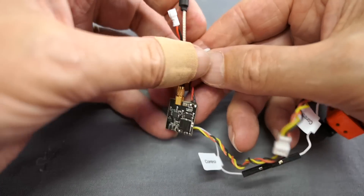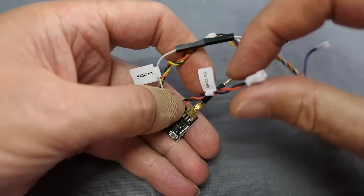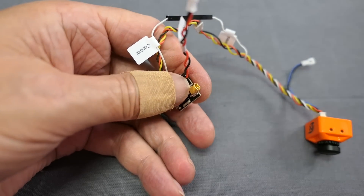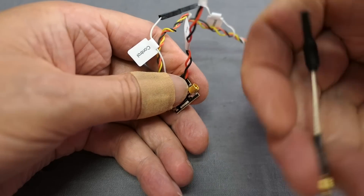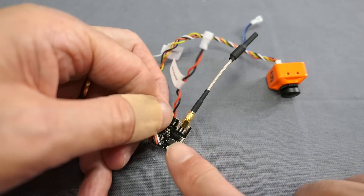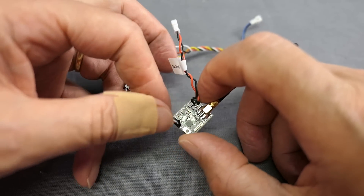Through to the tiny little video transmitter — we have a little selector button here for changing frequency and band, a 5 volt power supply, and these little MMCX connectors. There's a little SMA adapter alternative; we'll just use the little linear one for the moment — just clicks in, very nice and small. The video transmitter is selectable from 25mW, 200mW, 600mW, or pit mode, which is all very useful for quad racing.